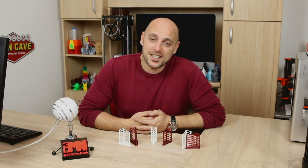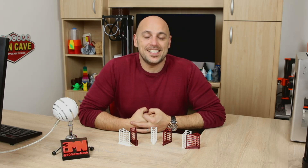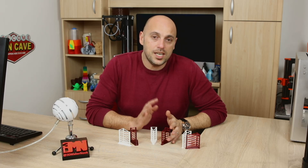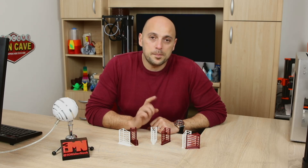Once done, this is the end result. I printed these six towers with exactly the same settings for each and every single one because I wanted a very consistent test — just to see exactly what the difference was between one printer and the other, and also one filament from the other. The only differences are temperature ranges: for RPLA the hotend was at 200°C and the heat bed at 50°C; for PETG the hotend was at 250°C and the heat bed at 80°C.